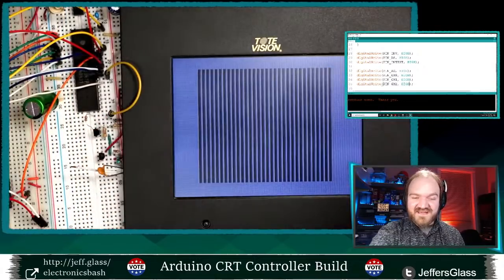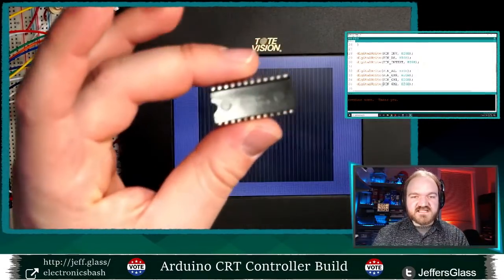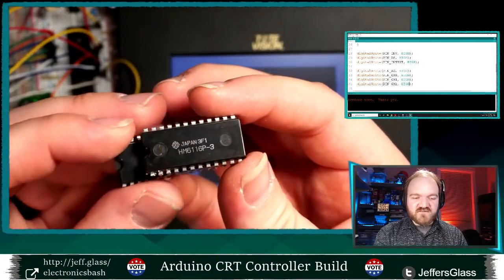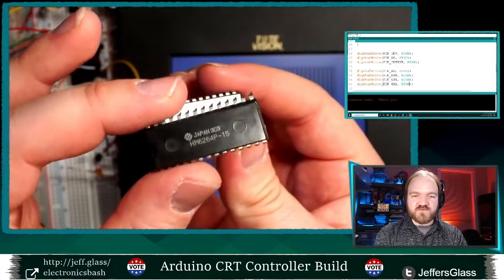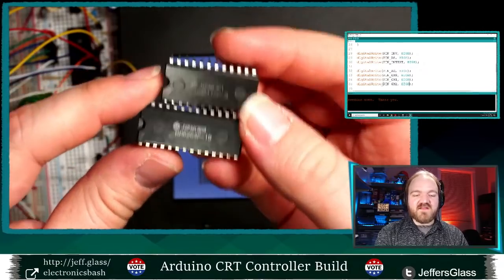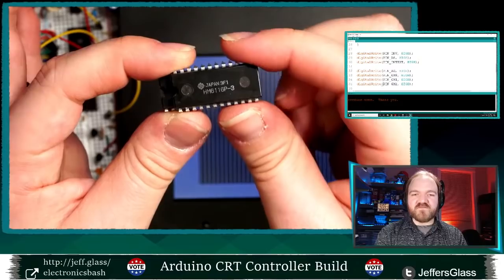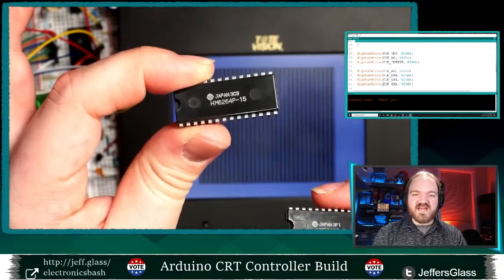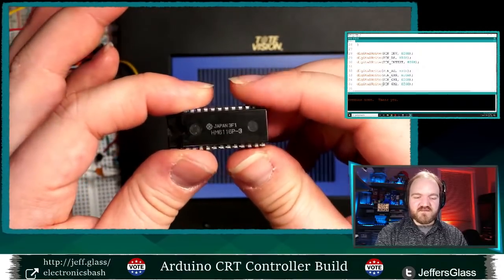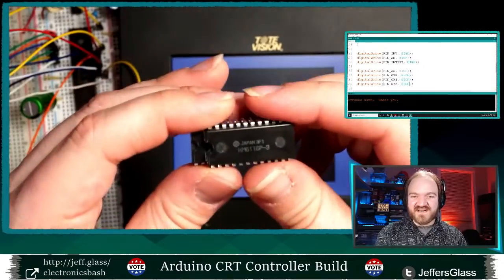But I think first, yeah, a whole 8 kilobytes. It's totally wild. I pulled a little collection of things out of my collection here. Oh yeah, so here's an HM6116. That's 16,000 bits or 2 kilobytes in a chip this size. One little fun side note: these were a fairly common product for a while and they were superseded by these. This is a 24 pin package. You can see it's a couple pins shorter than the other. This is a 28 pin package. A lot of devices actually were made that could use either. The lowest 24 pins on the larger chip are exact matches to the smaller chip. So if you had a device that was usable with a 64 kilobit RAM, you could use a 16 kilobit RAM, and you just wouldn't get the rest of the memory. The power pins are in the same place, the address and the output pins are in the same place. They just tacked on 4 more address pins to allow you to address more data. So sort of fun there.